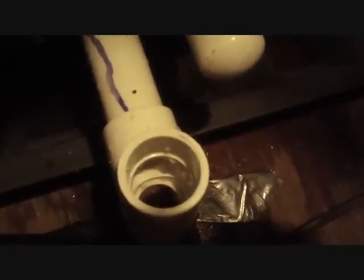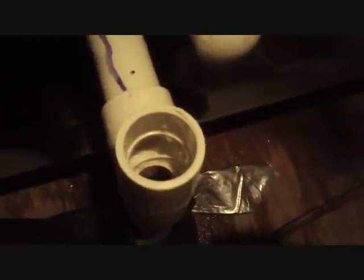Just so we don't forget — we were talking about it the other day and Brad was commenting on it — don't forget to prime the trap. This is a draw-through coil, and the pans in these particular units don't drain all that spectacularly. Make sure the trap is primed so you're not drawing air back through it and making it harder for the water to drain out of the air handler. Because it will flood, and the blower will take that water and fling it down the ductwork and all over the cabin. So just make sure you do that.